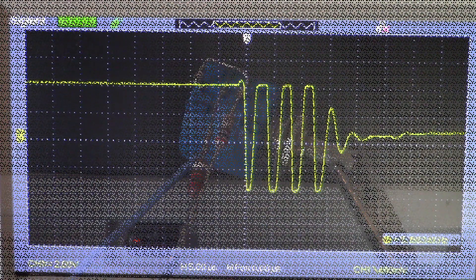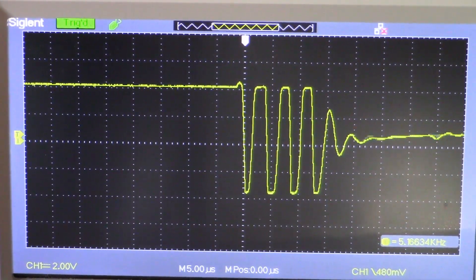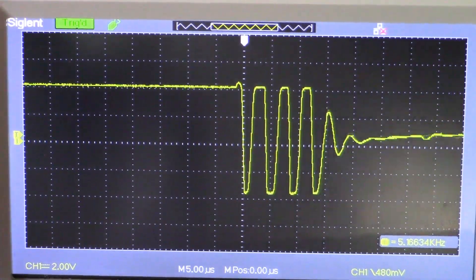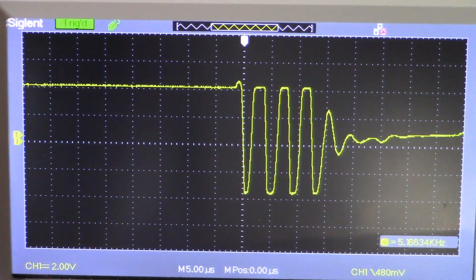What you see on the screen is the output of the preamp. I'm using a Hammerhead board — you can use whatever board you have available for a pulse induction machine. I have a 300 microhenry coil hooked up, nothing special, just a mono coil, and I'm going to go ahead and adjust this jig so you can see a marked difference in the waveform.